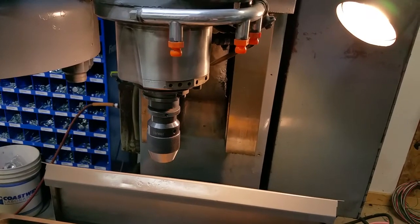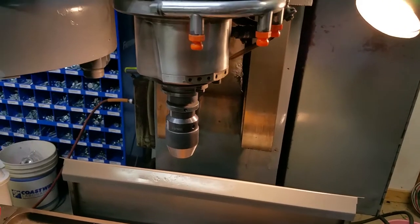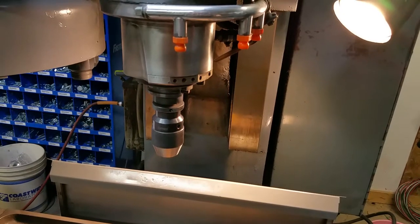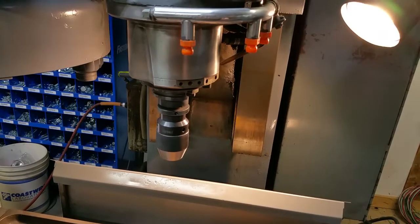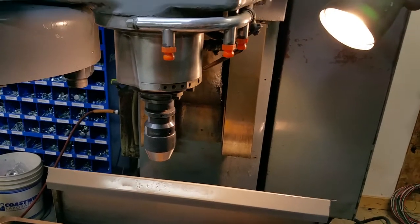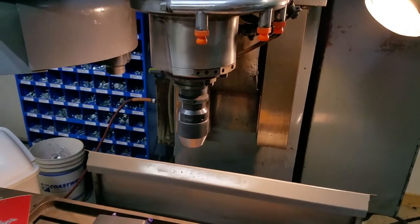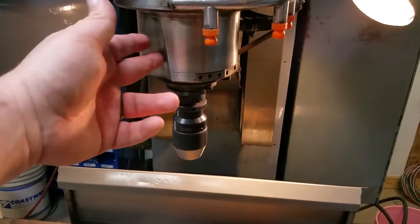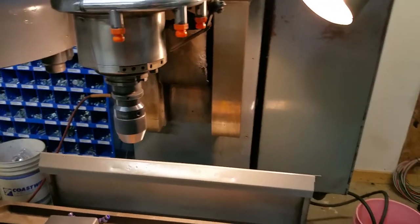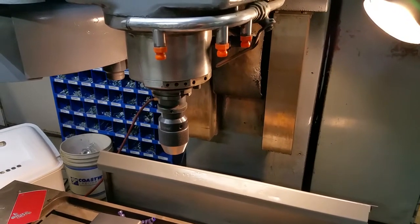That's how FIDAL chose to do it. The control was designed thinking it's a 10,000 RPM machine. But the spindle drive — since it's a replacement — was configured as a 7,500 RPM spindle drive. This spindle is a grease pack spindle, not an air lubricated spindle. I'm not sure if this was a 7,500 or 10,000 RPM spindle or what the bearing tolerances are. The control was originally designed for a 10,000 RPM spindle, and I've got all the settings tweaked in the drive.